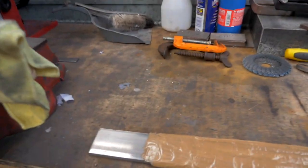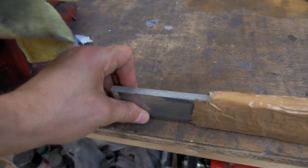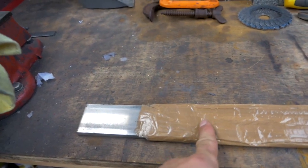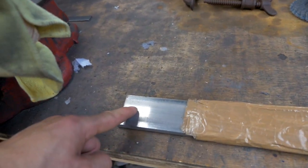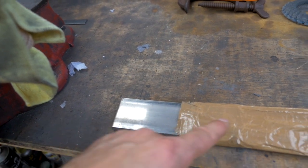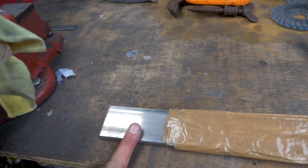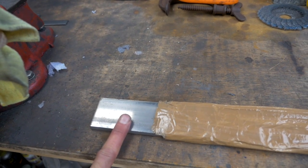I'm going to make that file guide and post this a week after, but I'm going to make it today, use it, and then complete that cutting in of the handle part prior to etching my blade on the live blade video — so they're kind of intertwined. I've got a load of 1080 steel here, a massive bar. I'm going to cut a piece off, cut it in half, then tap some holes on both sides, join it together, make sure it's flat, and use this as a file guide. I don't know if it's going to work, but let's give it a try.